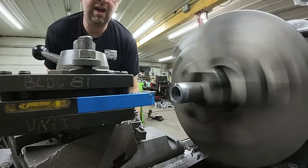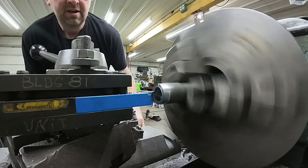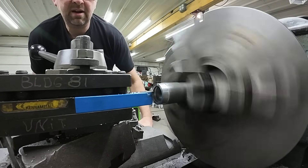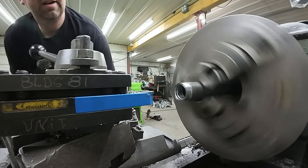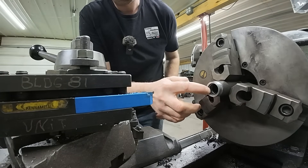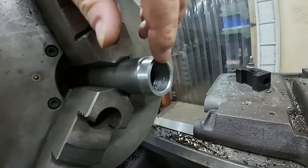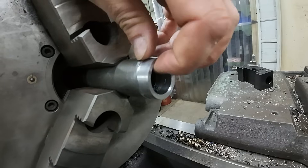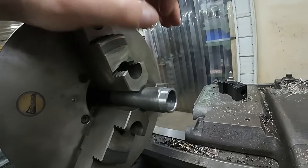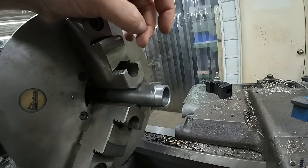I hope you can see that I have it just maybe an eighth inch high. And then I can come in a little easier and nail it. There is almost no burr on there — actually, a little better surface finish that I can feel. And that's why I do that. I lift the cutter a little bit on the internal chamfers.